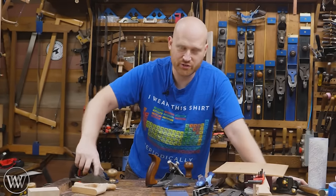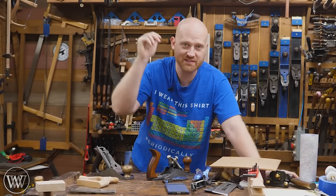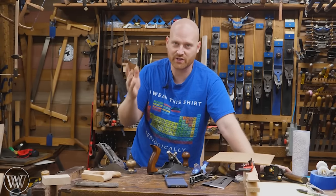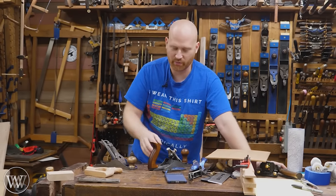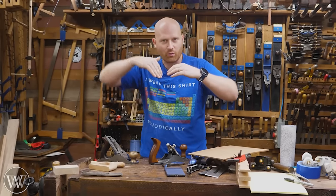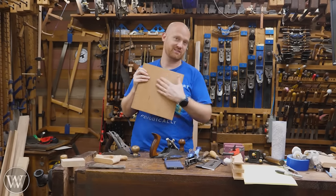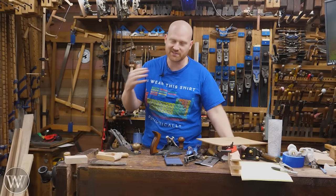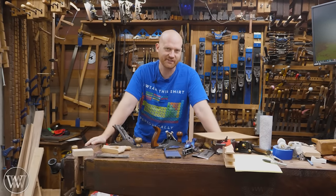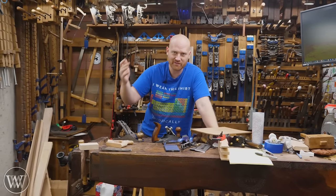Now, I didn't actually go through and show all of this — I have a whole bunch of videos on that. I actually have a couple of videos showing how to set up an amazingly fine smoother so it can do those crazy things; I'll leave links down below. And also, I'm going to be soon doing a project with Jeff from Read Plains — we've been working on it for the last few years to actually study and do the tests to find out what each of these aspects does: how close the chip breaker, what angle of the iron, how deep of a cut, how close the mouth, and what mixture of all of those goes into making beautiful shavings on difficult wood. Let's actually find out and do some scientific testing on that. But until then, just relax, have some fun in your shop, and realize you don't need all those settings for most of what you do.